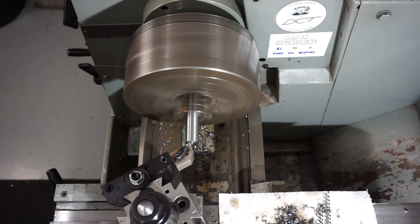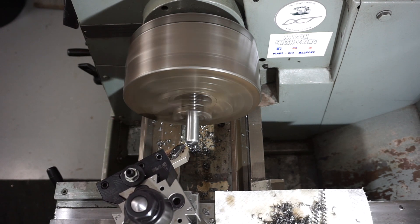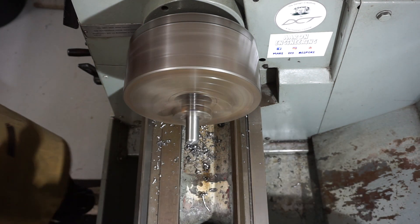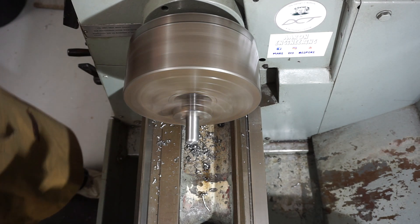Just a quick face-off here — you can see I've got the tool post angled and I'm just going to feed in to put a lead-in for that thread, a bit of a chamfer. I'll tickle that with a file. It's a beautiful old file, this one — I've had it for about 25 years. I actually used to use it when I was on the tools.